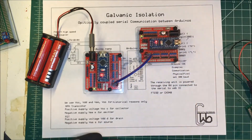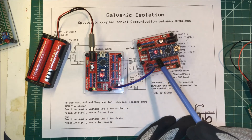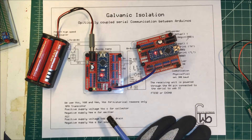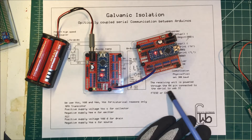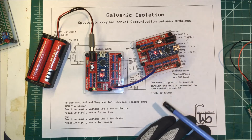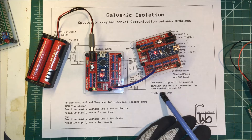Your TX line has got 5 volts on it and the signals ride on top of that. That RX pin — even the TX pin — is connected to the serial-to-USB IC, which is usually an FT-232 or, on the clones, a CH340. The CH340 is the chip on the back of these Nano boards.